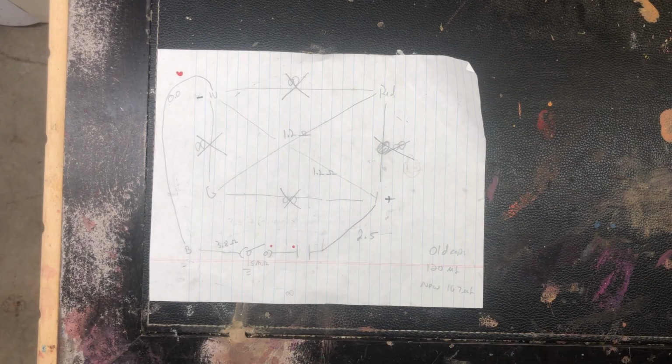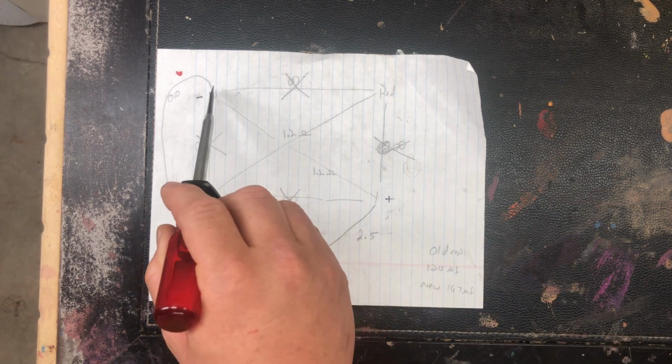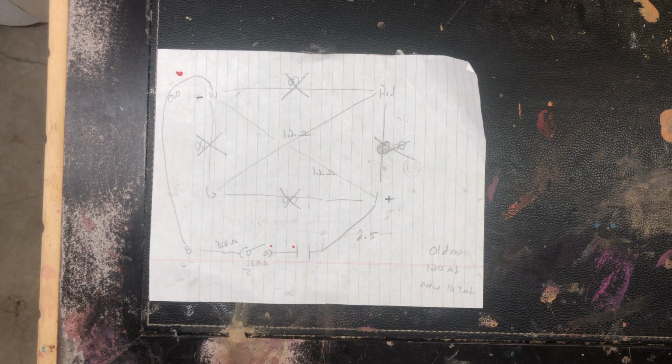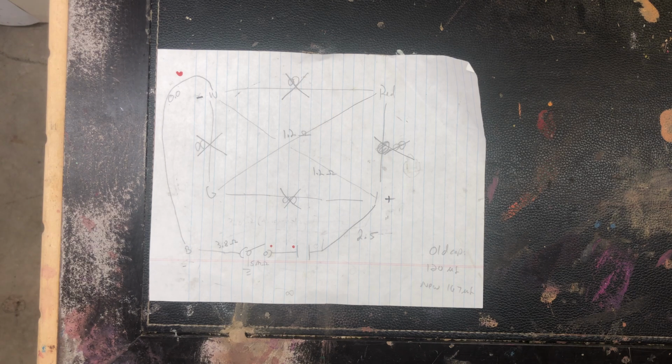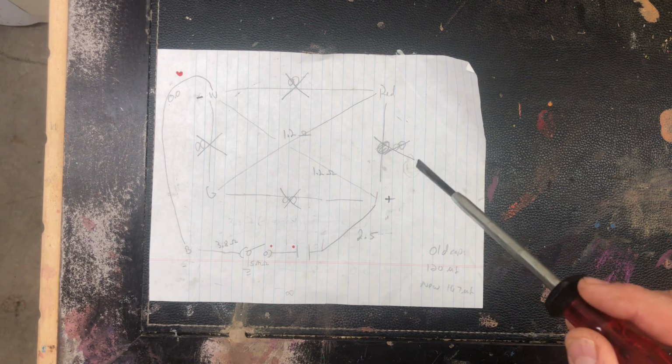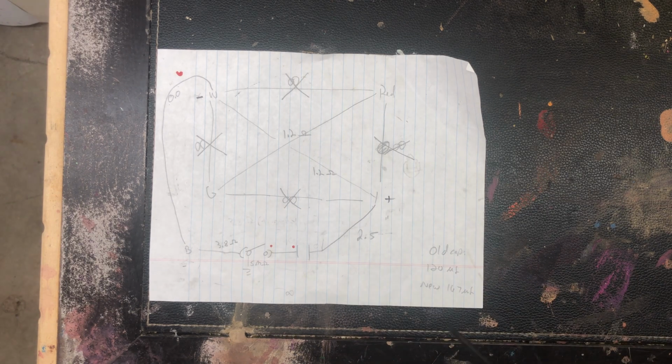Pretty cool, actually. So during the week of troubleshooting and racking my brain trying to understand the problems, I decided to map out the motor. So you saw the post-it note in the first video where I had noted that red and yellow were positive to the wall, and white and gray were neutral to the wall. So I made those 4 things here. I had watched a couple of YouTube videos on how to do this, and basically you just measure each possible combination and see what the resistance is.